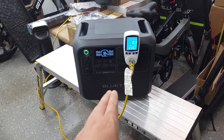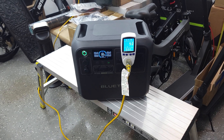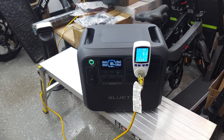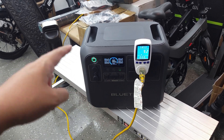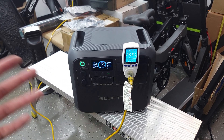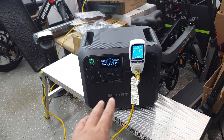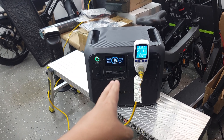One other thing I really like on these Bluetti units is the power lifting feature. This unit has 2400 watts from the inverter, which can power pretty much anything in your house — fridges, microwaves, coffee makers, hair dryers. But if you plug in more things and need more than 2400 watts, power lifting will run resistive items at a lower wattage than they require. So if you have a 1200 watt heater but already have 1500–1600 watts plugged in, a regular power station would shut off — but this one will still run that heater. By using this you're able to power up to 3600 watts of devices, which lets the power station do much more than a unit of this size traditionally can.